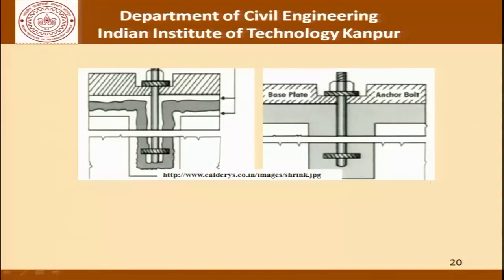This picture is a schematic representation of shrinkage. The space created because of shrinkage of the grout or mortar is shown here. As against that, the next picture shows no space created — this is an example drawn from grouting an anchor bolt in the case of a foundation, where if we do not use proper shrinkage compensation material we could have these spaces which become zones of weakness and permit ingress of deleterious material that could damage the bolt or reinforcement.